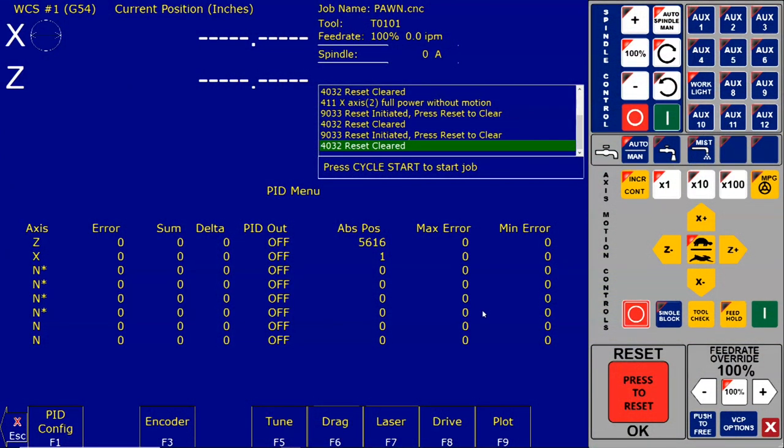So we saw the encoder counts increase as we rotated the shaft clockwise. Notice the AC-DC drive needs the encoder correctly connected and wired before starting up the CNC11 software drive. If the encoder is not detected upon startup, you'll need to restart both the AC-DC drive and the CNC11 software before trying to test the encoder again. Users can troubleshoot drive errors through the HSC bit screen definitions as described in the AC-DC servo drive manual.